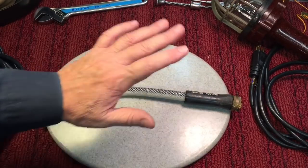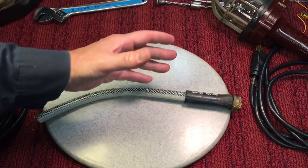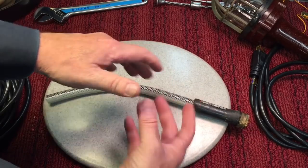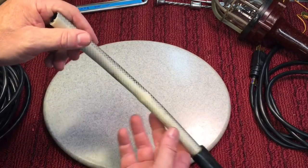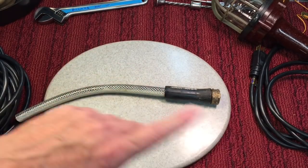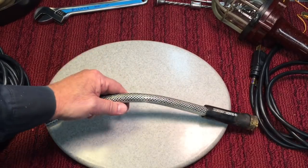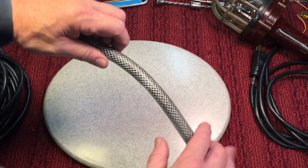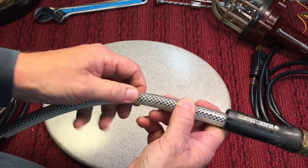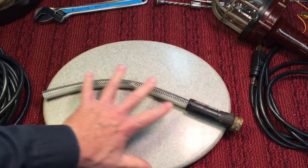Here's the interesting part. You always have to think of any electrical cord as carrying current — and they call it current for a reason because it acts just like water. If you had a large hose, how easy water can go through it; but the smaller the hose gets, the more restrictive it is. That's the same thing with wire and electrons — millions of electrons running up and down that wire. If you don't have enough wire, it tends to overheat. Also, just like a garden hose with a kink in it creates restriction — with a wire that kink would cause it to get hot. So always think of it like a garden hose.